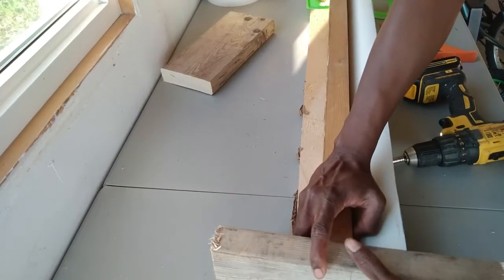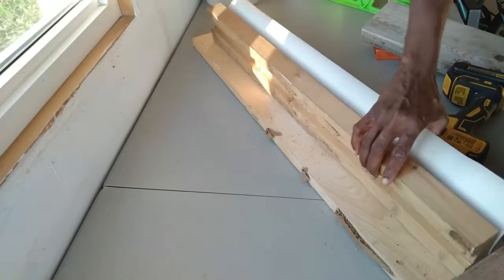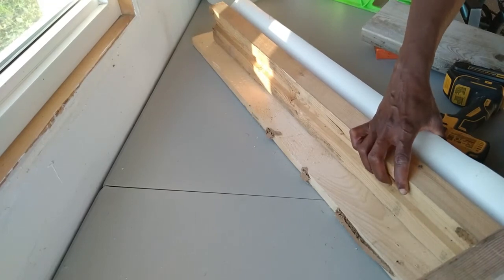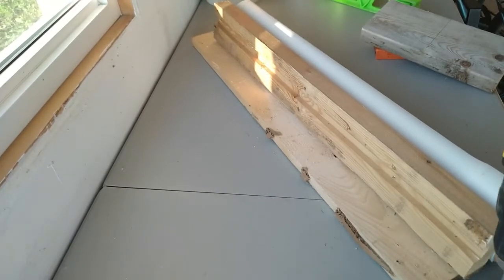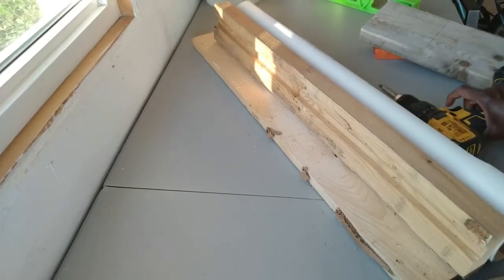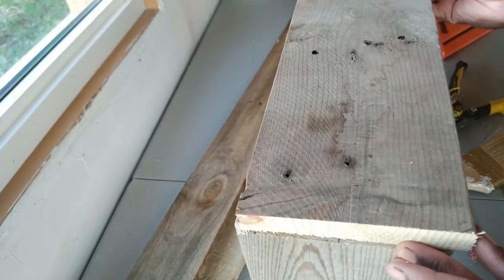For me this was a simple build, and I feel like it's easy enough for anyone to do on their own once you're comfortable using a drill or even a handsaw. The most difficult part would be attaching the legs to the two-by-four that has the sewer pipe on it, because at that point it is very crucial that it's centered. That's why I took my time to measure and find the center, making sure the two-by-four isn't too far to one side. I dropped the line and made sure I could see it so that when I was screwing in, everything went to the right place. After the legs were attached, it was easy going into the final build.